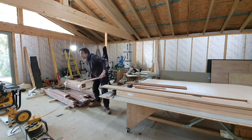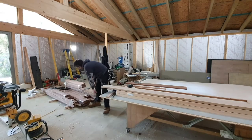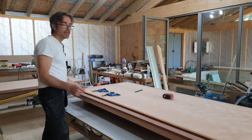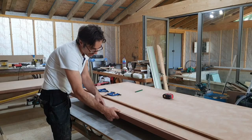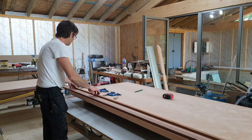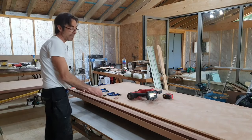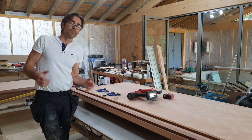I'm cutting the door blanks down now and putting an 18mm sapele edge all the way around the doors. The idea is this edge is then covered by the stiles and rails, which are bonded to them as well, and when planed back they'll look like one solid piece. I'm gluing them on and using an 18-gauge brad to fix them temporarily. The little pin holes will fill during polishing. Importantly, I don't want to get my pins where the hinges are going to be.